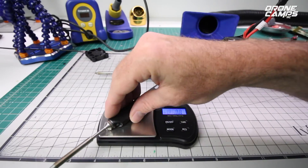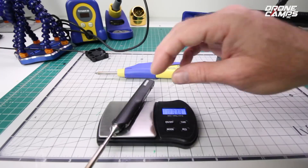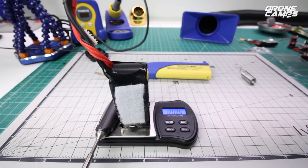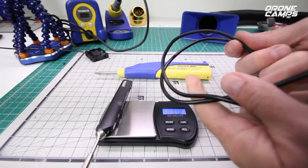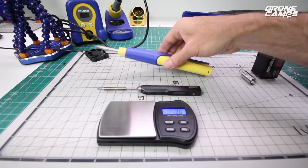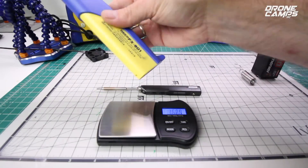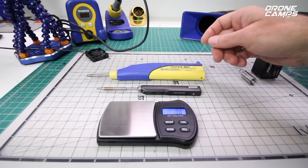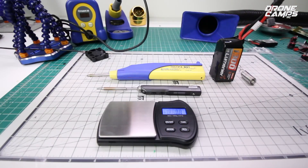Let's go ahead and weigh the TS-100 on the scale here. I've got 31.2, 31.3 grams — that's pretty light. Now with the addition of a 1300 4S battery, you're looking at 200.5 grams total travel weight, and that's not including your cable with your XT-60 on there. Now let's weigh the Hakko FX-901 — I'm at 168 grams with batteries inside. The nicest thing about the Hakko FX-901 is that it doesn't have cables hanging off the back of it, so you don't have to worry about hooking up an extra LiPo. You can just use some rechargeables inside there.